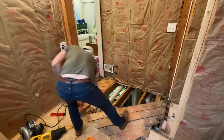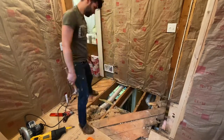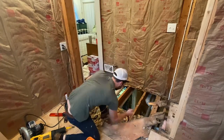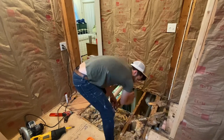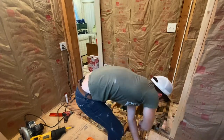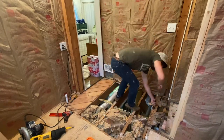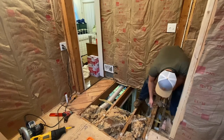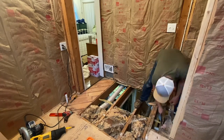Now as the floor is getting ripped up enough to start seeing the floor joists or supports underneath, you're going to really need to start inspecting those and making sure that they aren't rotted as well. If they are, you're going to have to replace the rotten ones and make sure the house is structurally safe. These are in good shape, and thankfully I have a basement underneath, so I was able to go underneath and check this out. Once I noticed the rot, I was able to inspect the floor joists — everything is in good shape and we should be just fine.